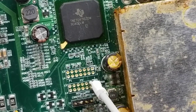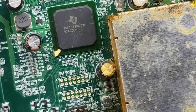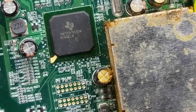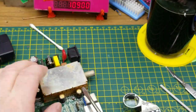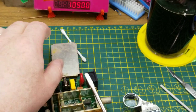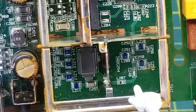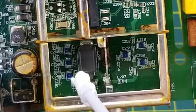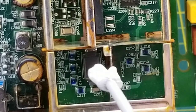That covers most of the mysteries on the main board — except for what's underneath this RF shielding can. It's not soldered down. First thing in after the connector, we have a bunch of inductors, a bunch of capacitors, and a big honking inductor with more little surface-mount inductors. That is just RF filtering.